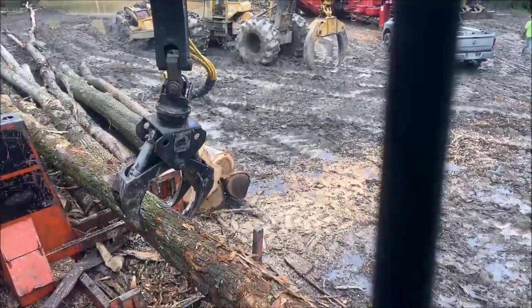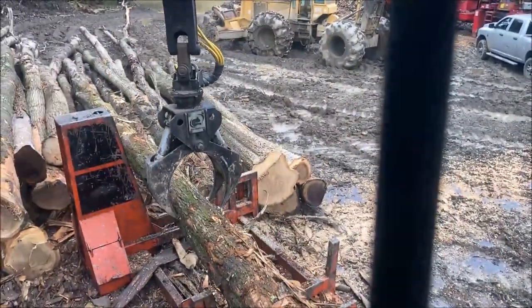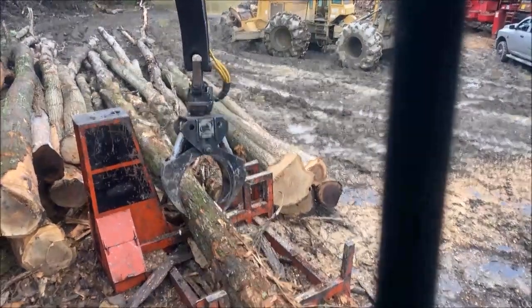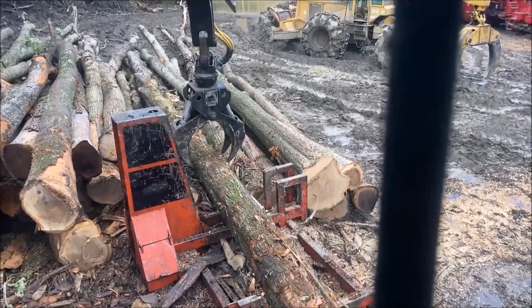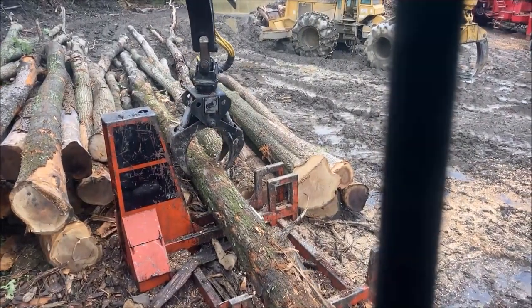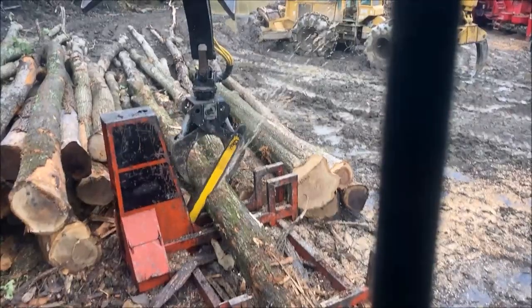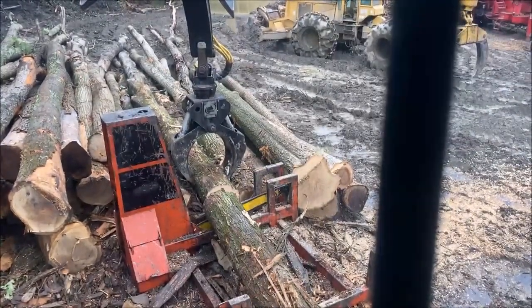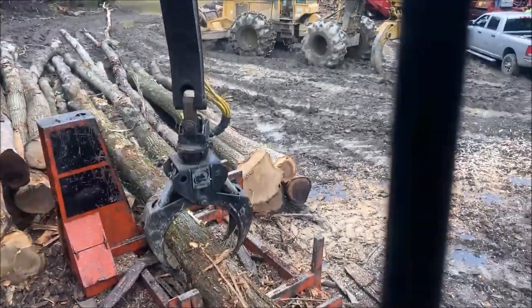we got soft maple here. We're going to cut a clean 10. Number 2 soft maple, I'm told, is doing better than number 2 red oak, so we can throw a little bit of a dirty one in there. Now, there's no worm. Worm is those squiggles in the end that they say make ambrosia maple or whatever. Well, they pay us for blocking for that, but here's a good indicator of a good clean log.